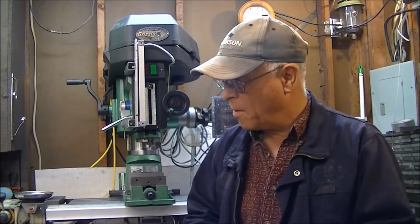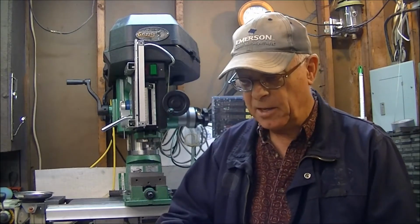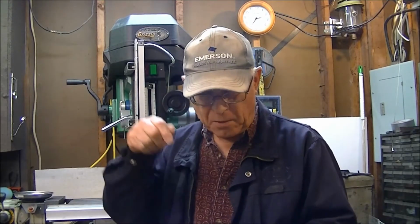And I've got a bottom pour Lee production pot, but I can't get this up under the bottom of it because it's too tall, so I may have to trim a little off the bottom and a little off the top until I can get it to set up under there, or modify the production pot to make just one continuous pour. I think that would make it easier.